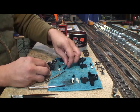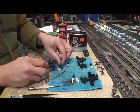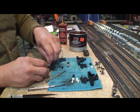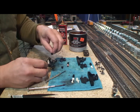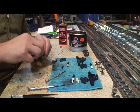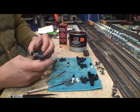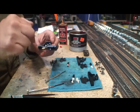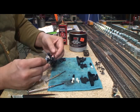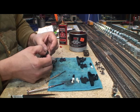Now to put this together: the one gear that has two gears on it is your idler — it connects to the worm. All gears go face down, big side down, with the large one at the front. Let me drop them in — some are different colors, white or black, but that doesn't matter; they're interchangeable. Then fit the worm in there, getting the little couplings at each end matched up, and in she goes.